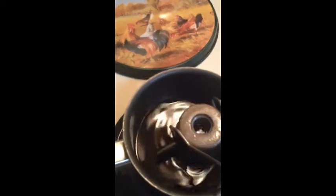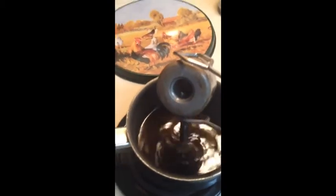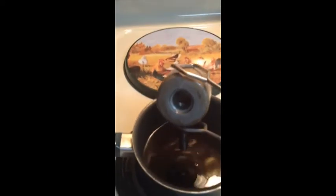When you're done with your base former, it is hot, hot, hot. Grab it with some tongs, drain the wax out, and set it on a hot plate or something like that to let it cool down. Then take your residual wax from reforming and pour it into one of your molds.